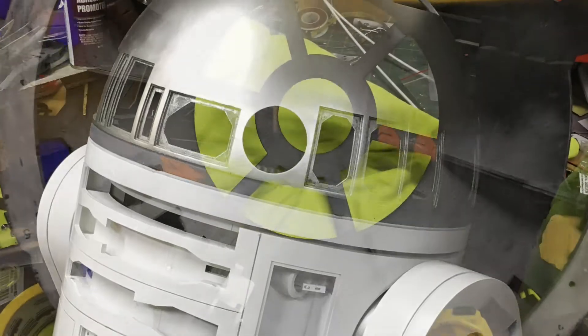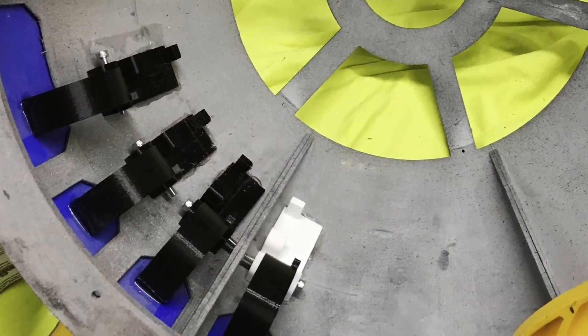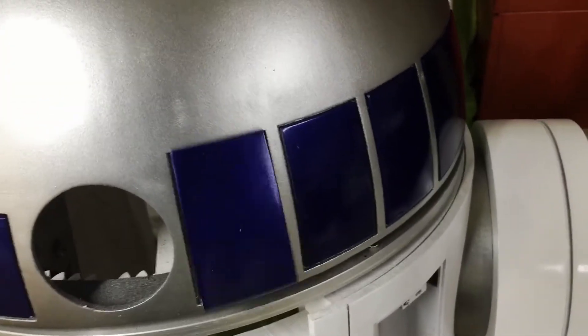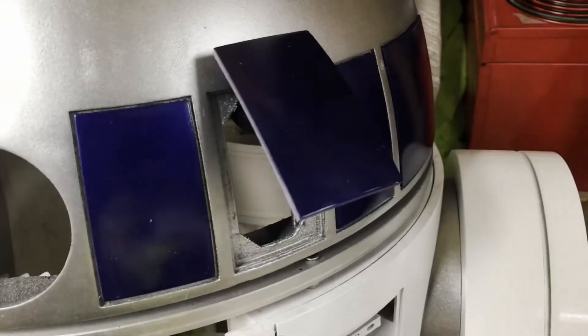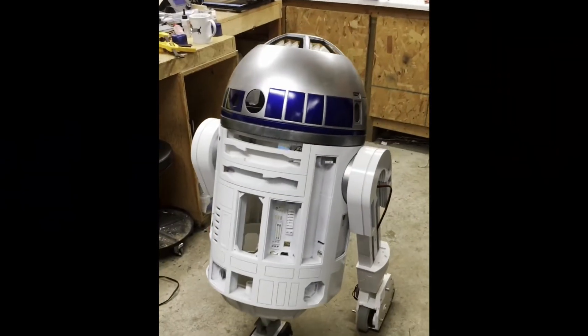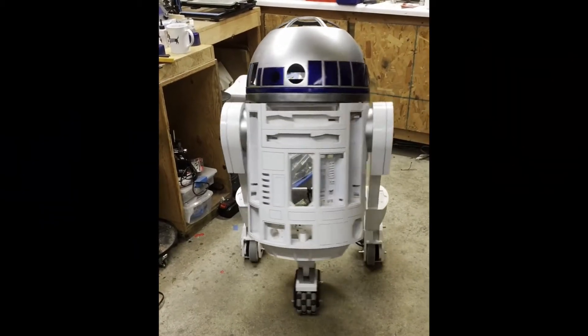Here's another shot of them all together. This is the shot of the inside hinges and the way they're fashioned inside. Initially I used double-sided tape to stick everything in place. This is where I noticed I had to sand down the top of each pie plate piece slightly at a 45-degree angle so they would clear the dome as it went up.